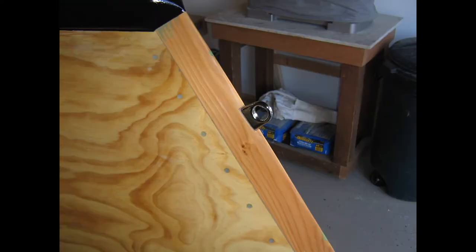I used some of the leftover epoxy to install the bow eye. You could also use 3M 5200 marine adhesive sealant here just as well. On the interior, where the bow eye goes through the stem, I drilled a 1-1/8-inch diameter spot face about an inch deep into the stem, based on the threaded length of my bow eye. I didn't want the threaded portion sticking above the surface of the stem for safety, so your knuckles don't bang against it and nothing gets wrapped around it. I have enough room in there to fit a couple of washers and the nut to hold it nice, tight, and secure.